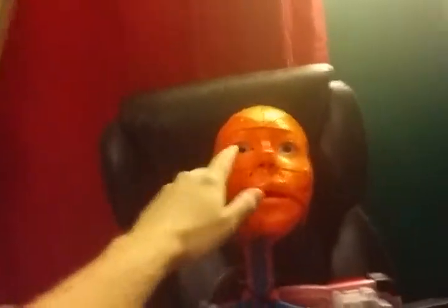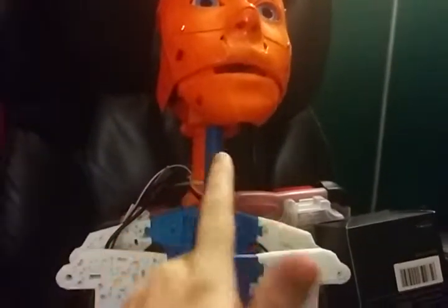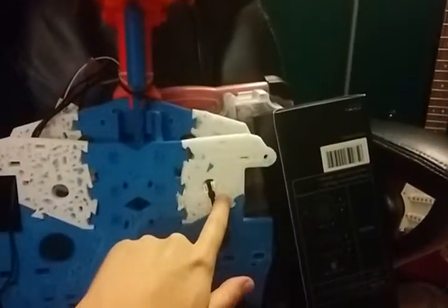Right now I have the eyeball camera in there, the neck motor's in the head, the jaw motor's in there, and now I have a speaker here — a little cruddy RadioShack speaker that takes a nine-volt battery. This is not connected up yet; still don't know if I'm going to use it. All these cables come out through the back, they're all labeled — neck, jaw, whatever. They go into a USB hub, which then goes into a Raspberry Pi, which then goes into this breadboard, powered by the power supply. The Raspberry Pi is controlled via SSH.